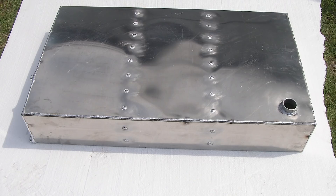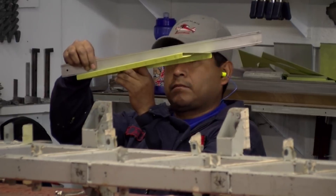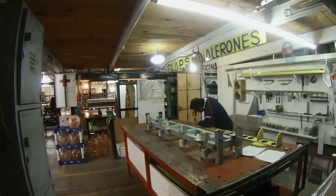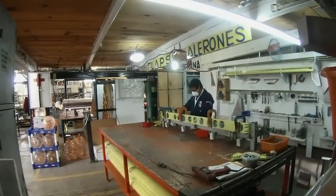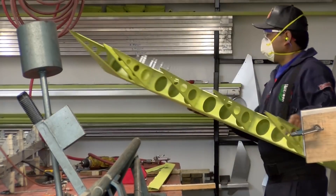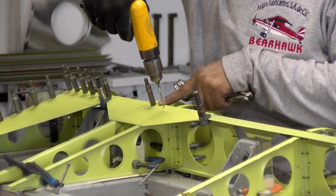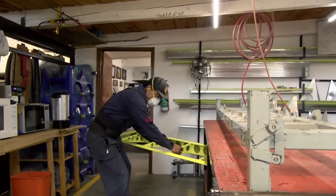This is what a finished tank looks like. One worker's job is to make the ailerons and flaps. Juan begins by straightening all the ribs and making sure the flanges are 90 degrees to the web. Here you see Juan's work on an aileron during the course of a day. Ailerons and flaps are assembled in special jigs. Then after all the drilling and deburring of the holes, the flaps and ailerons are ready for riveting of the nose skin and finished to an advanced level of completion. After all the work is done, an aileron is put away.